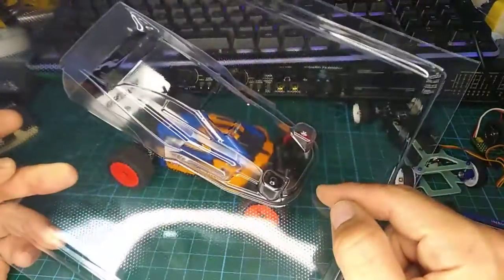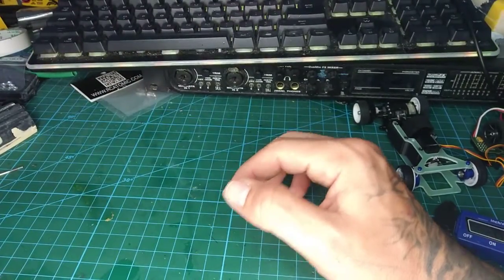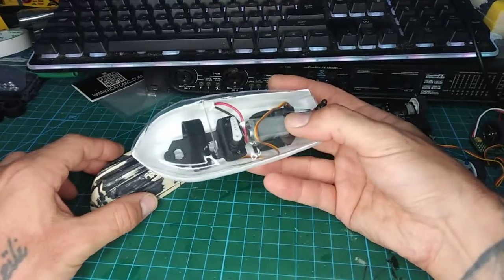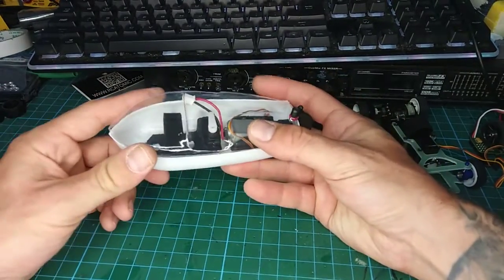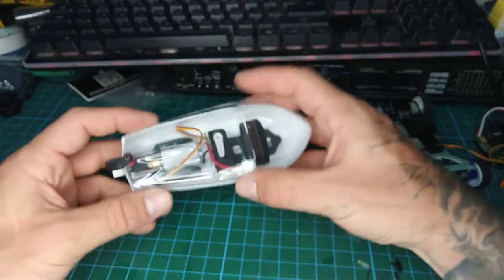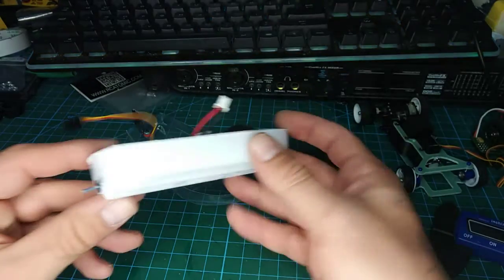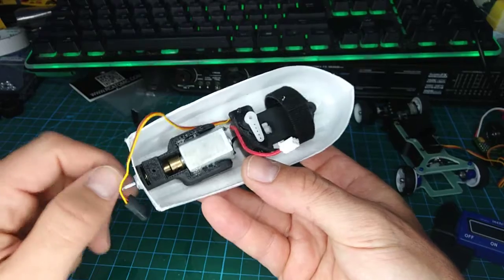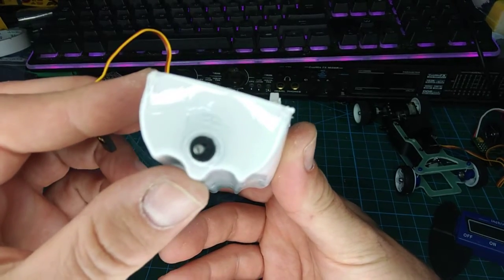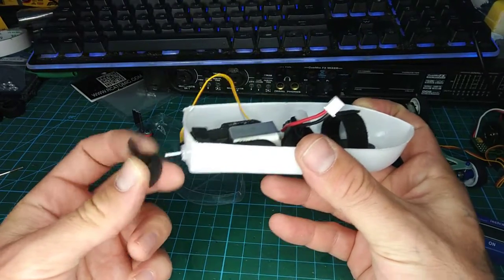So that's for that. And last but not least, I have been studying and working on a little boat design, because I have the vacuum forming machine and I have electronics, and it's the summertime and my son has a tiny pool on the roof, and why not? So this is very far from done. It's still a work in progress, but what I have so far is one 1mm hull over here with a motor mounted, and that is clipped into the body over there. So this is sealed, and then there are the 2mm shafts sticking out over there, which I'm going to use with those tiny propellers at the back.